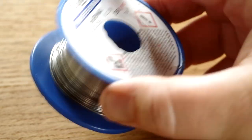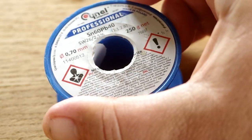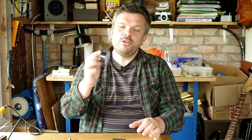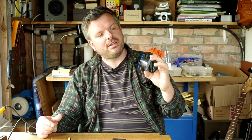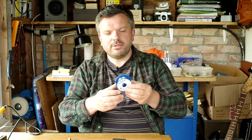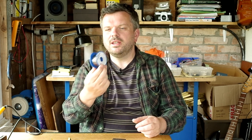Next thing you're going to need is solder. I use solder from a company called Cynel — C-Y-N-E-L — it's made in Poland. It's 60-40 lead-tin split, so it does contain lead; that's up to you whether you want to worry about that. If you aren't keen on that you can look for alternatives, but this is what I use and people have been using it for decades. 60-40 lead-tin, 0.7 millimeter diameter — that's what I use day in day out. When buying solder, beware of unbranded options on online marketplaces as they can be shoddy, crumbly, and just don't flow right.